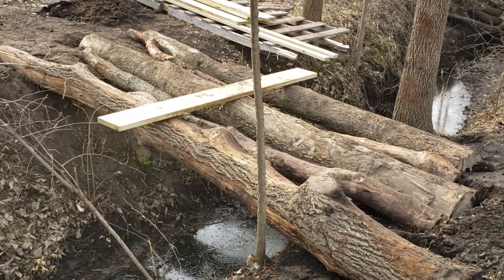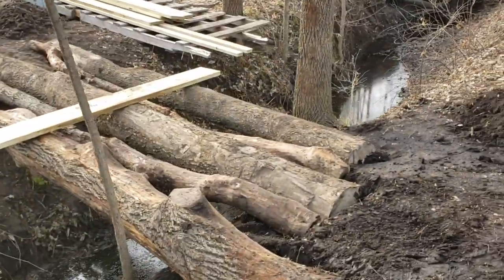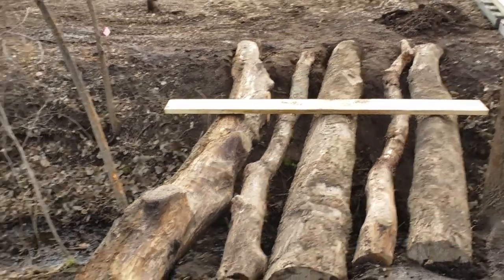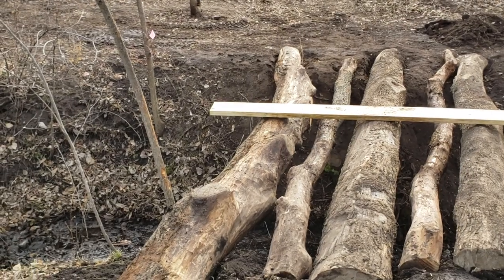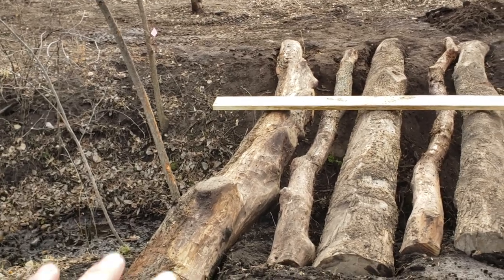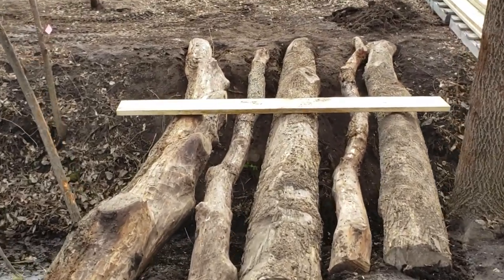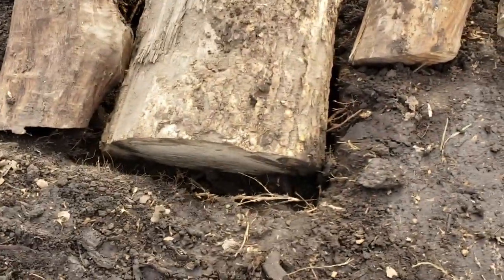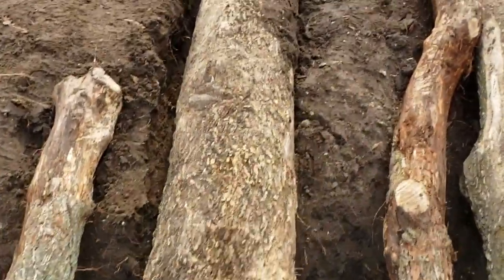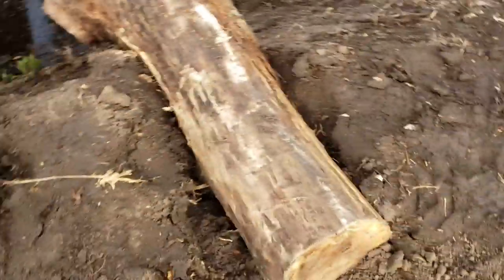What we have to do is figure out where the high points are — I'm going to have to eliminate them. I didn't want to have to do that. We wanted to get this crown to go up, but this log just would not stay in that upright configuration. There were certain spots where it wanted to bite into the ground and stay, so at a certain point we just had to accept it. It's extremely strong. We don't have any concrete in yet, but my plan is to work on the high points so I can get the decking down, and then dump in some concrete to hold these logs in place.